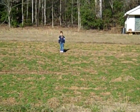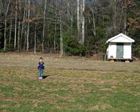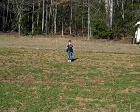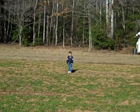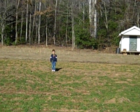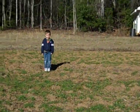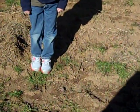But so I'm going from here up to where my son is, and I'm actually shooting through this and leveling it up at the bottom of where he is standing. So from my eye to where he is standing, right at the bottom of his feet, is about 70 inches, just rounding off for easy calculation. So from my eyes to the bottom of my feet is about 70 inches, and so I'm going to go up there to where he's at. And so the elevation from that spot down there to where Elijah's feet are is 70 inches.